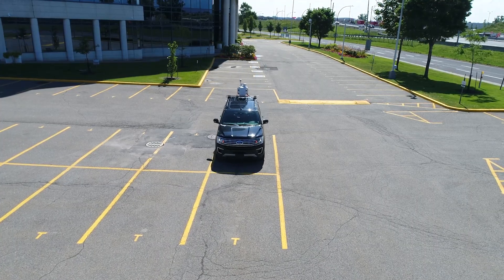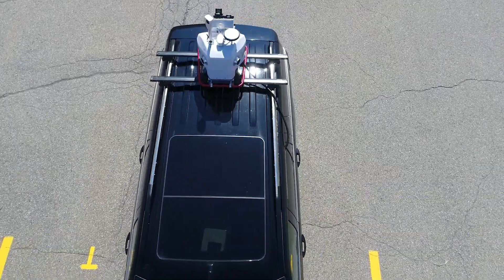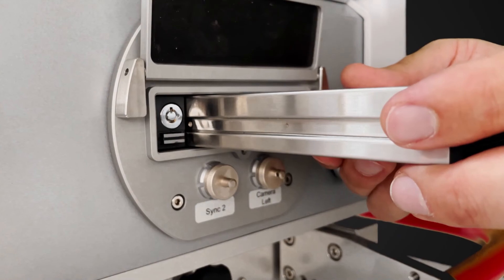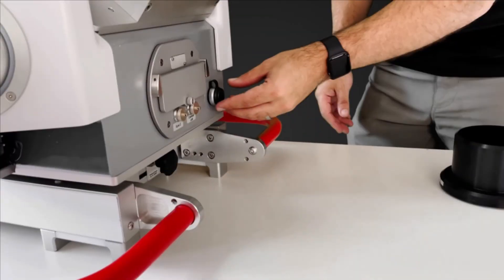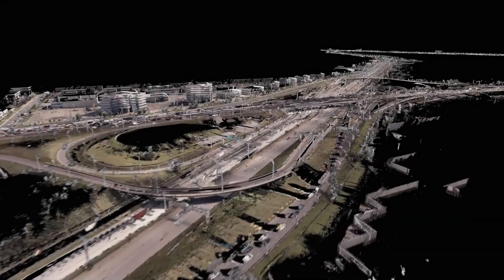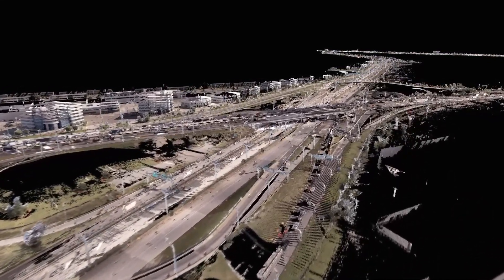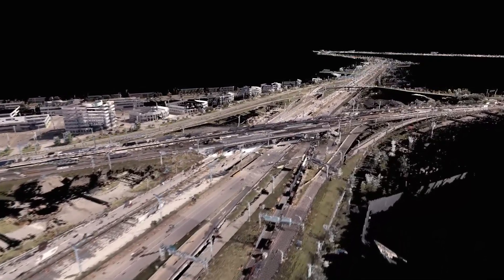At the end of your scan, be sure to close out with a second 5-minute static session for your GPS to finalize its location. The Pegasus 2 Ultimate is equipped with internal hard drives that make transferring your data to the office a breeze. You can also plug in a USB drive to start working with your data instead. Getting our point cloud data into our computers is as easy as taking out the removable hard drive from the Pegasus 2 Ultimate and plugging it in with a USB cord.